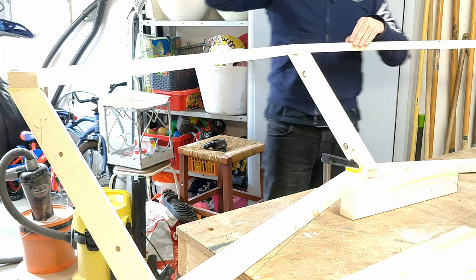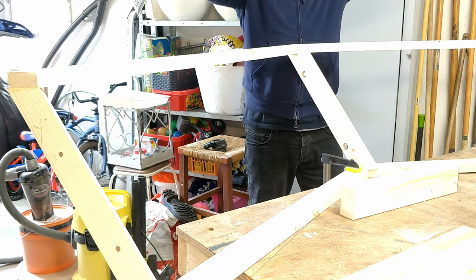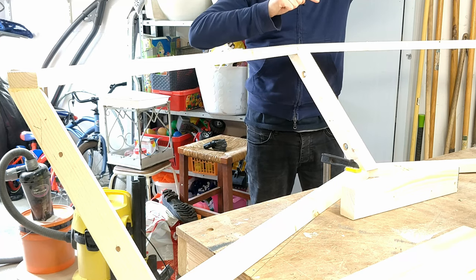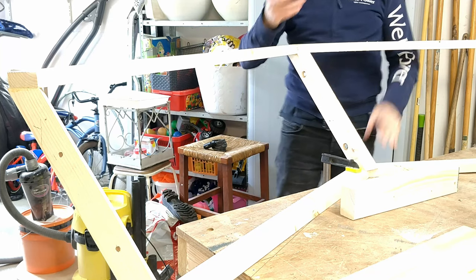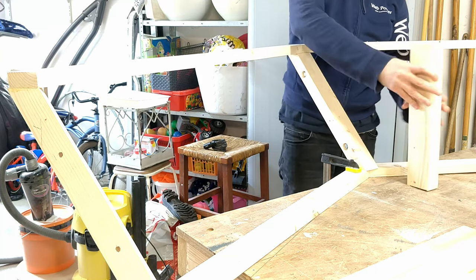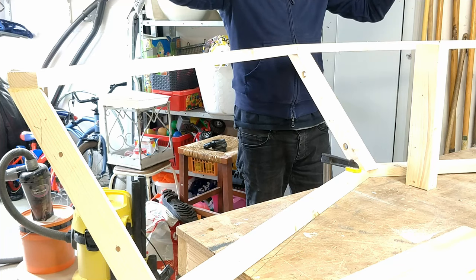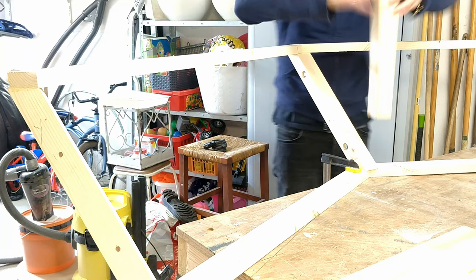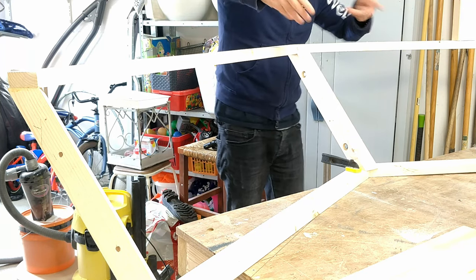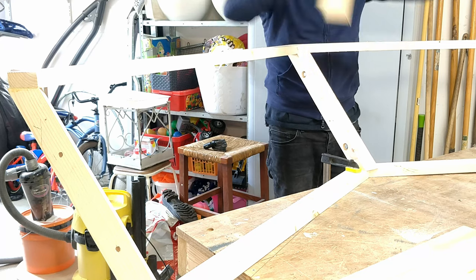We know that the top side of the window is horizontal at the same level as the start of the overhead panel, and the overhead panel starts at 20 centimeters from the highest point of the MIP. That means the MIP has to be 20 centimeters from the highest point of the window. I calculated how much I need to lift the windows from the MIP stand - they'll sit on four pillars, one in each corner, connected to the MIP stand at the back.